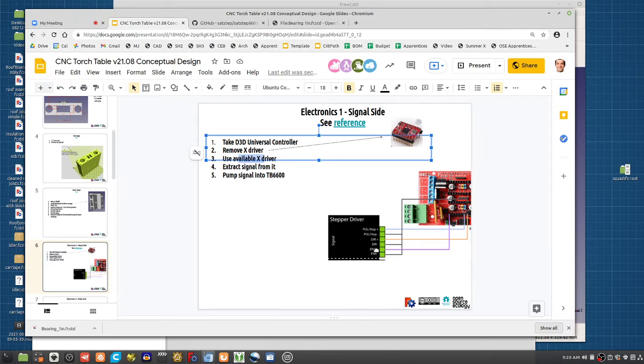You need the pulse, because of how the stepper works: it gets a bunch of short pulses of signal. It's on off. Stepper motors work by on off control of successive windings in the stepper motor. So here you need enable, direction, and step, which is how fast the steps are going, which direction, positive or negative, like counterclockwise or clockwise, and enable, which just enables the thing.